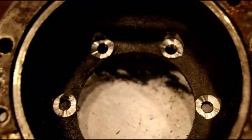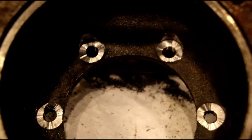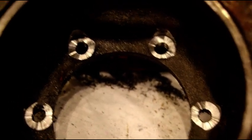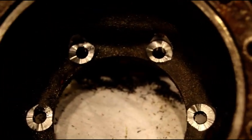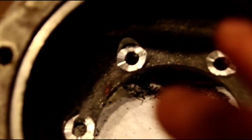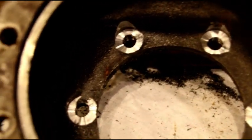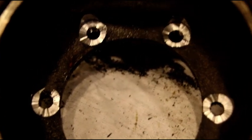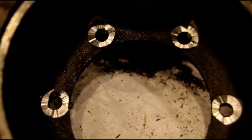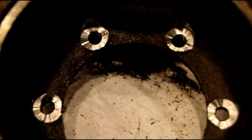Okay guys, after a little bit of horsing that tool around, you can see the nice cuts we got. Next thing we're going to do is run a 3/8-24 tap through all those guys, clean them down with acetone — get them squeaky clean. Because we are going to Loctite our bolts in there. Critical setup — it has to be clean. So we'll run a tap through, we'll clean it, and I'll be back to show you the bolt I selected.